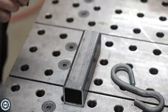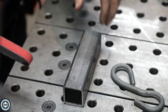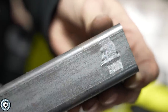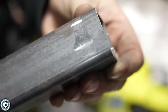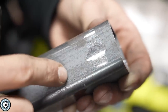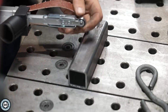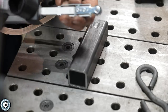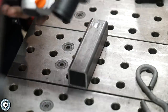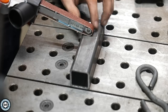This is just a piece of mild steel, but I want to show you the difference between having a rubber contact wheel on the end versus having just a metal bearing, and the difference in finish you get. With a rubber wheel, you can grind a pretty fine area. This is an 80 grit belt, so I'm not getting a super fine grind anyway, but it is pretty clean and can be smooth with a higher grit belt. Let me show you what happens with a metal bearing.